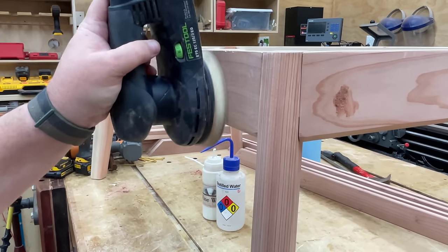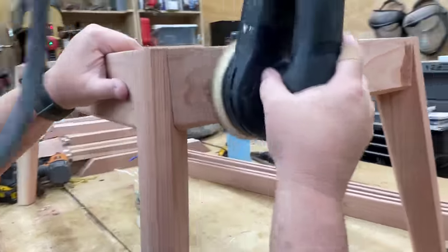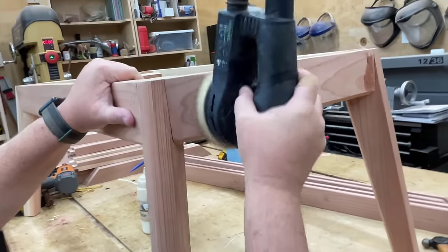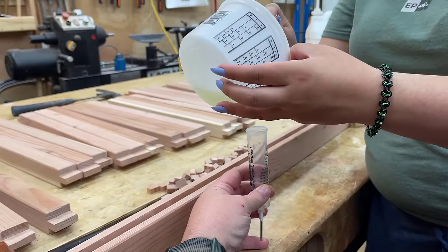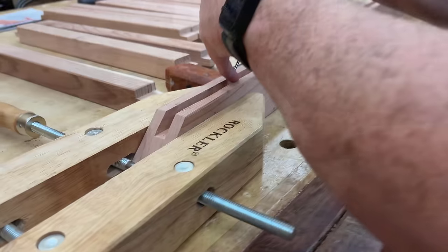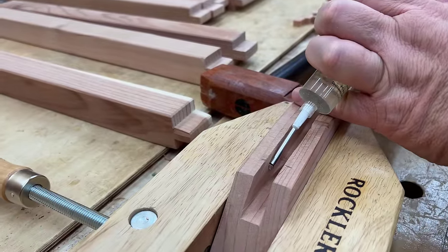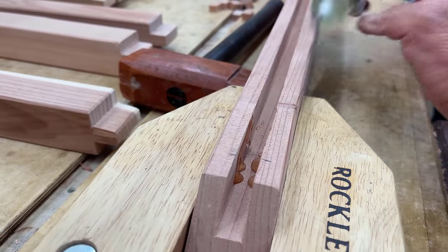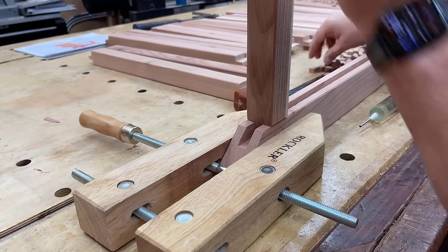Next step is to sand off these plugs. Once they're sanded off, they're really not that unsightly. You can use dominoes, dowels, or just screws and some plugs — a lot of ways you can do it, and a lot of people building outdoor furniture aren't going to have expensive joinery tools. Now I have a syringe and I'm going to put some epoxy in it. This is how I'm going to assemble the 2x2s into the dado slot. This is a 20 ml syringe with an 8 gauge flat needle — you can actually get these on Amazon. These are perfect for epoxy or any other adhesive — it keeps it nice and neat, doesn't allow it to spill all over, and you can put the adhesive right where you want to.